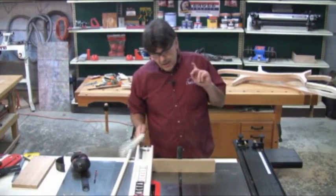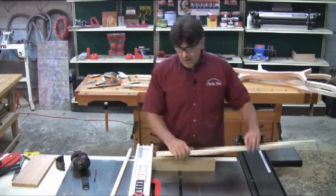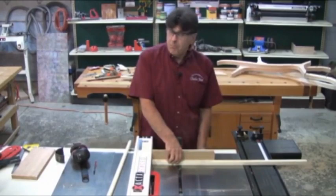And going ahead and cutting your tenons in the square is also safer. Now, if you're turning dowels and buying dowels to do this, be very, very careful. Because like I said, this thing is rotating in my direction, the blade, and what it can do is try to take that and spin it. Setting up a clamp system or something would be a good idea, because it can rotate that thing and it can catch pretty quick. So be careful.